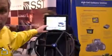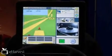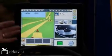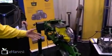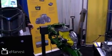As you can see here, as I'm driving through the field I'm marking where I've been using the GPS position. And if I go across any land that I have already planted, automatically I know that I've been there. So I'm going to turn off the air clutches as I go across the field. Each of these are connected to a row unit, and therefore we're controlling every individual row on the planter.